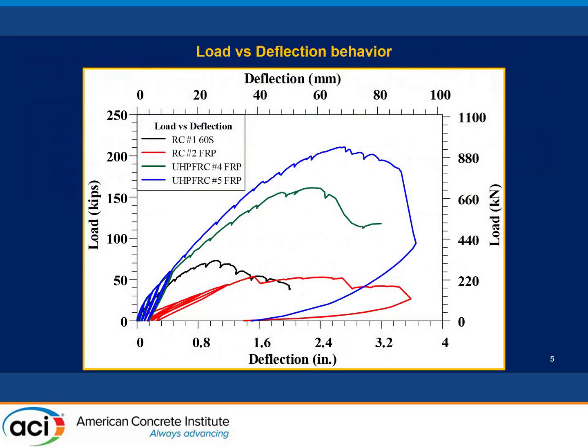This is basically the result I want to show quickly — what I mean by high stiffness. The top two specimens with AFRP combined with UHP FRC, designed by the new method, show stiffness much higher than conventional. The red one, plain concrete with AFRP bar, has much smaller stiffness and strength. The black one is RC — the largest strength you can get based on tension-controlled design, ACI 318 or AASHTO LRFD. All four beams have exactly the same cross section.